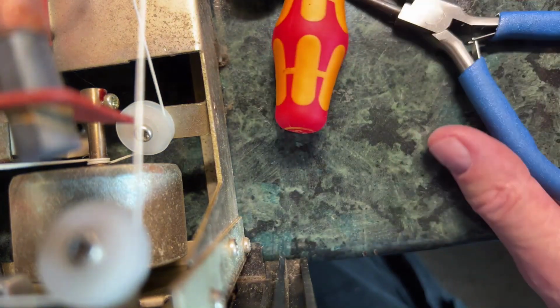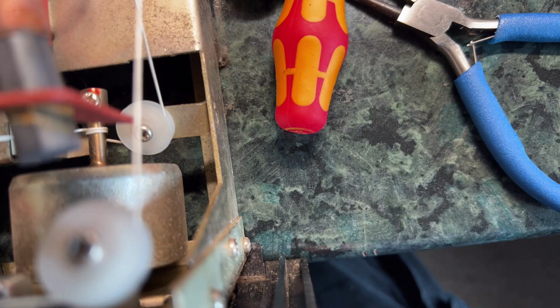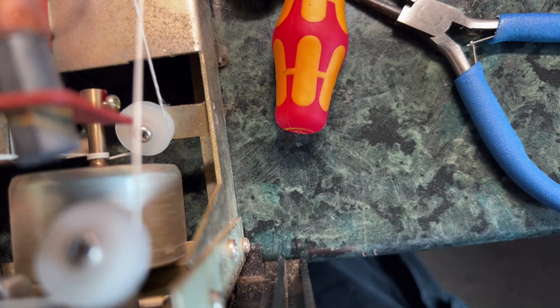If I push my pliers in there and artificially hold it so it doesn't jump, you can see it goes all the way, and now I can get it over to 108 with some horrible grungy noises, but now it's okay, you see. As long as I hold it there, it stays okay all the way up, and I turn it back. There's the frayed bit again. It goes through that way, that's fine. Goes all the way back, comes back here, spreads itself out a bit, gets to the thinned out bit, and jumps across and breaks. Well, it doesn't break, it jumps across and twists itself into an impossible position.